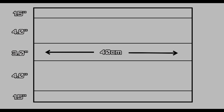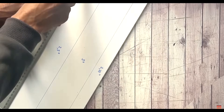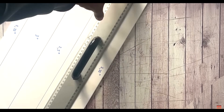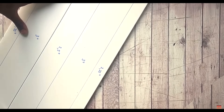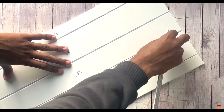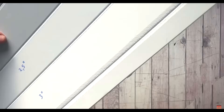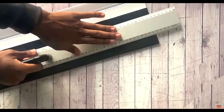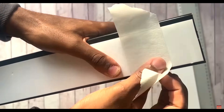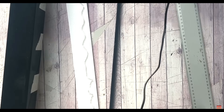Here are the dimensions of the fuselage I'm making out of 5 millimeters thick foam board. Because the original footage and pictures were accidentally deleted, I've added a fragment from a previous build video since the building method is the same. The method uses experimental airline techniques — you can see me conforming the shape of the fuselage and temporarily taping the outer edges together to hold the shape while the glue strip hardens, after which the tape is removed and the fuselage is finished.